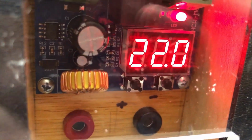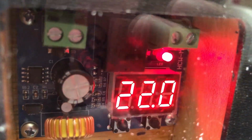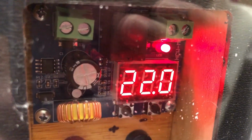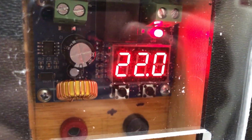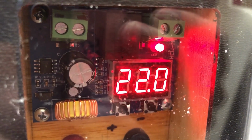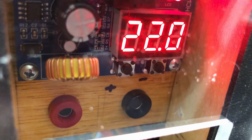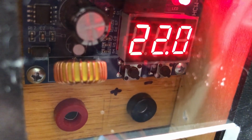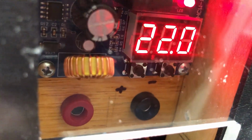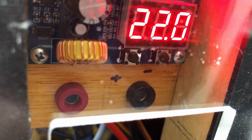So I saw this fancy little meter here, control box. This circuit board is a low voltage detector, and I've got that connected with the auxiliary battery pack. And this LED meter is reading the voltage that's in the auxiliary pack. It's got banana jacks on there, so that I can charge the auxiliary batteries without tearing the robot apart. And there's jacks I showed you already on the other side for charging the main batteries.